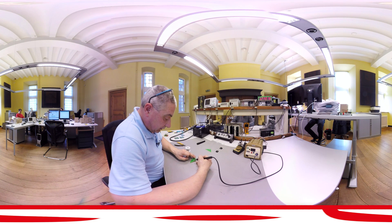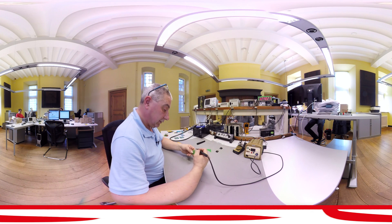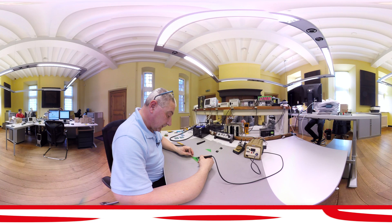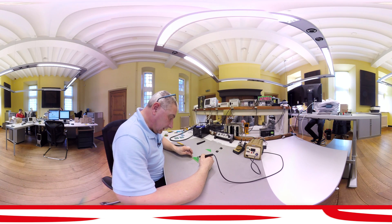I'm going to turn it for you. First I'm going to solder one pin on this side. As you can see, it's a bit high — just heat it and push it down, and you're done. Now I'm going to do the remaining pins on the other side and on this side.